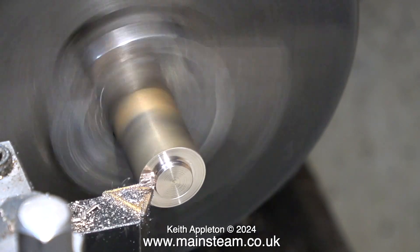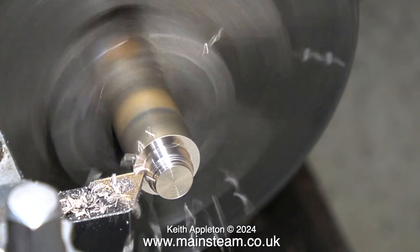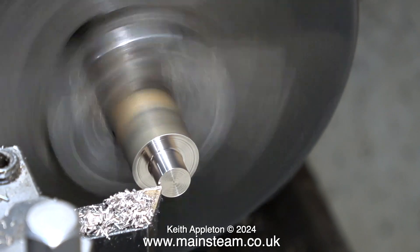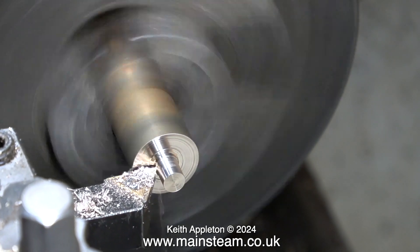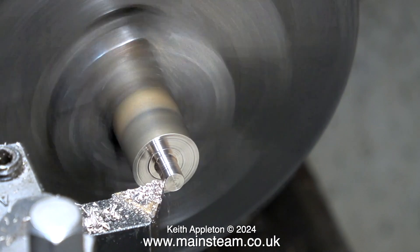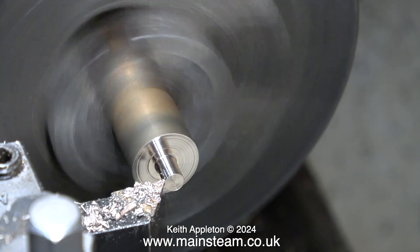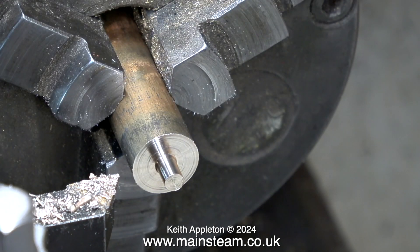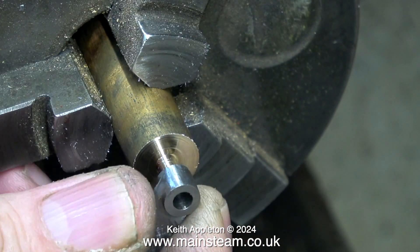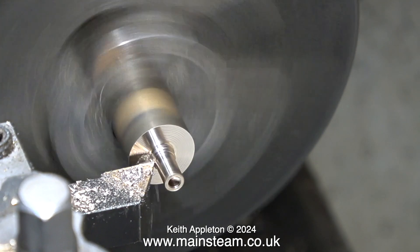Here we go again — I'm doing something wrong to illustrate how you should not do the job. I need to machine a piece of phosphor bronze to make a bush for the oversized hole in the drop arm, and initially I was taking far too great a cut, which is why the tool was jumping about. As I've previously mentioned, as you move towards the center of a piece of work it slows down, so you have to slow your cut down as well if you want a good finish. If you take a really fast cut down a bar in the chuck, you're not going to get a good finish even at the outside diameter, unless the piece is revolving at a very high speed. The general rule is: the lesser the diameter, the lesser the surface speed.